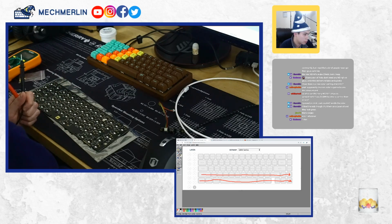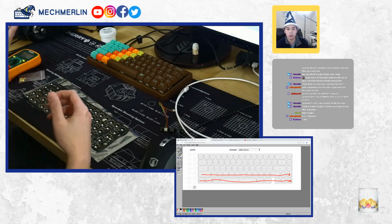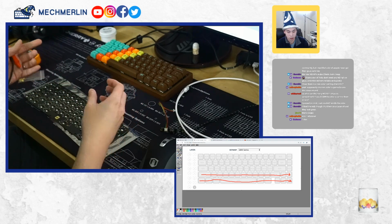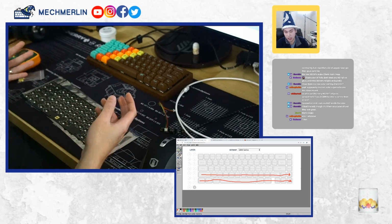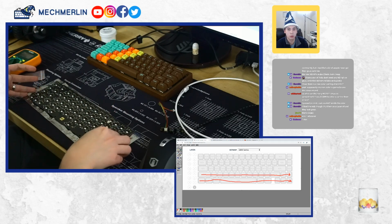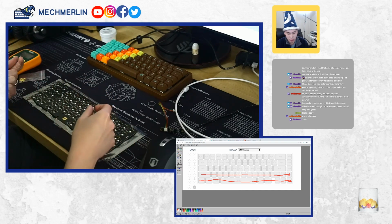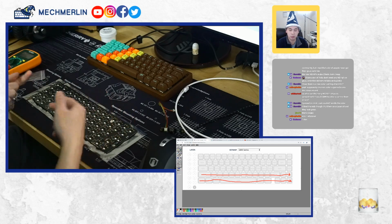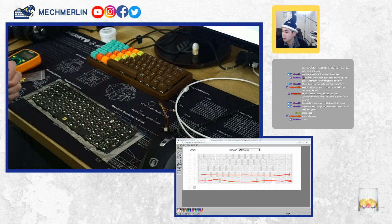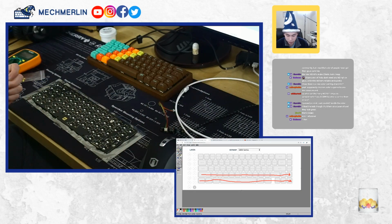My thing just died, but what this does, if you separate the RGB LED and the controller, you're not limited to the size of your strip, because you can just take those two components and have like an infinite number of LEDs. Well, maybe not infinite, because you're still restricted by power, but if you were just to do the regular strips, you're limited to what the manufacturer sells. Maybe a strip only comes with 10. Maybe a strip only comes with 20. So that's the benefit.